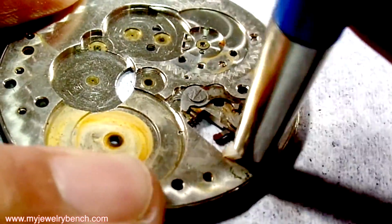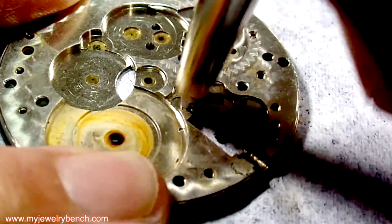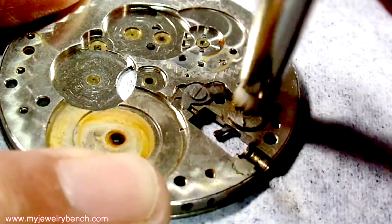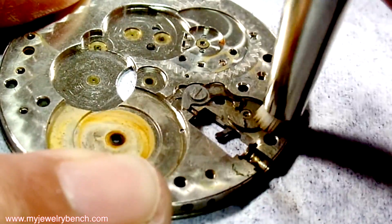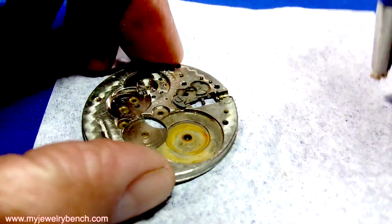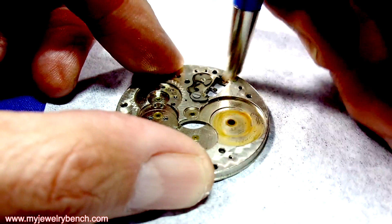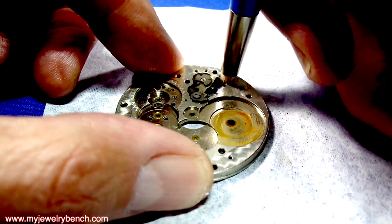The nylon brush is better to use when you have light rust damage because it doesn't leave much debris behind. It will leave a little bit of debris, but for the most part you're going to wipe it all down, loosen all the rust up, and then you can start the next step. So you can see the tip's getting a little dirty, and that's okay. I'll just throw it in some cleaner, sometimes I'll use acetone or mineral spirits, and that just loosens up some of the surface rust a little bit better.